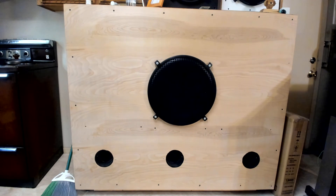I've seen speakers like these in home theaters and in cinemas. All my speakers have Speakon connectors on them — the 40-amp grade ones. And I try to use 12-gauge speaker wire on all my subwoofers because I'm pumping a lot of power.